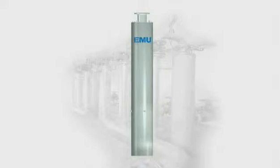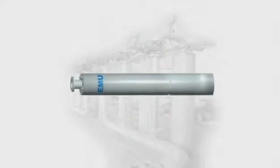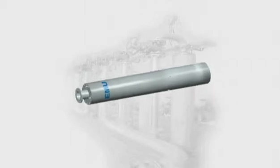The pressure shroud pump can be installed vertically or horizontally. The discharge connection is always in axial direction. The intake can be axial or radial at each place requested at the pressure shroud. Through this, there are various adjustment possibilities to the existing pipework system. All connections can be designed as flanged or threaded connections.